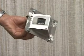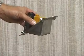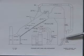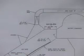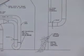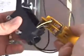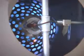A photoelectric scanner may have been purchased with the Humidaire unit. This device detects when cotton is present and turns the water pump on the Humidaire unit on or off automatically. Mount the scanner in the lint flue riser about 10 to 15 feet before the battery condenser. If suction from the riser is used to draw humid air from a reclamation hood or other moist air apparatus, we recommend mounting the scanner upstream of the entry point so that buildup on the scanner window from condensing moisture is avoided. The scanner requires 3 copper wires to connect to the main humid air control cabinet in accordance with the external electrical connection wiring diagram.